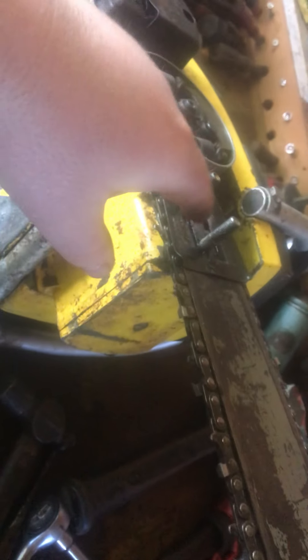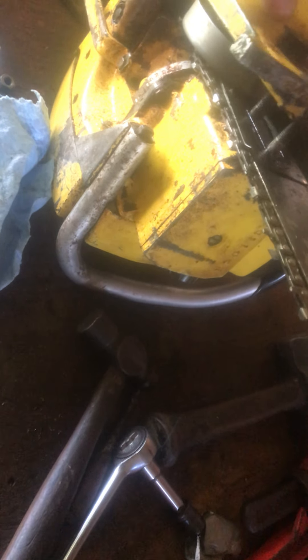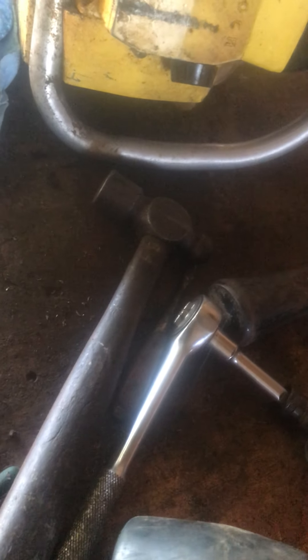Before I leave this video — see that? That's where that nub is going to sit, right in this hole right here. You want to make sure you have this plate. This had two of these plates on there, but from what I looked up you don't need that second plate — that second plate is not supposed to be there, because the chain was not fully sitting with the bar. Turns out somebody had just put double plates, so you're only supposed to have one.